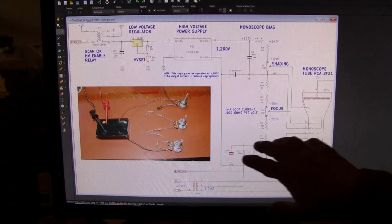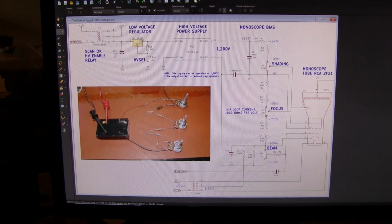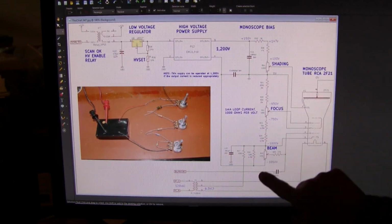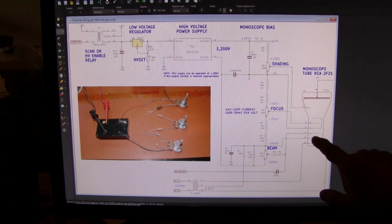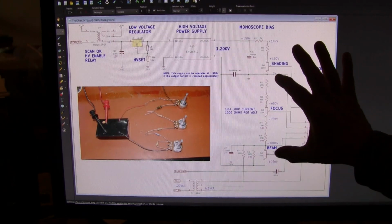Now, I designed all of this based on the tube data sheet and the EMCO power supply data sheet. That's wonderful. This is what I call on paper. So before we build this thing, waste our time putting it all together to find out it doesn't work or it's pulling too much power, let's breadboard just this stuff here. The tube, when connected to this chain, which is running 1 milliamp, draws literally no current. The tube's impedance is so high. Notice there is no physical connection from the cathode to here except a very faint cloud of electrons. It's in the megohms.